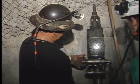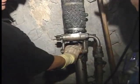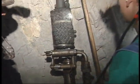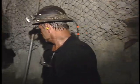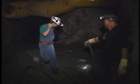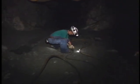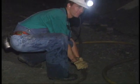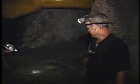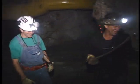And this is your throttle. You always want to make sure it's in an off position. And this is your leg. You want it in an off position. Okay, so back. All right. Now we'll get our water hose. Turn that on just for a second. Good. Shut it off. And the same thing goes for the water. You've got to wash them all out too.